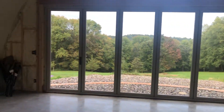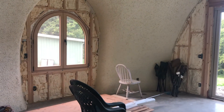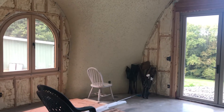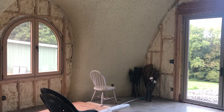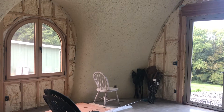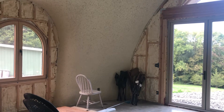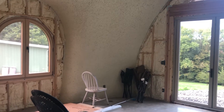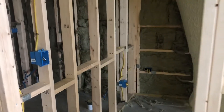For other updates: we finished the rest of the spray insulation to fill the cavities. These are six-inch exterior walls — two-by-sixes — so we filled them pretty much all the way and cut off the excess. There is almost six inches of consistent insulation throughout.